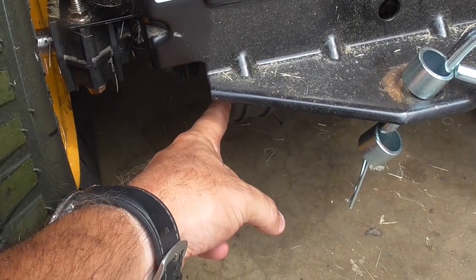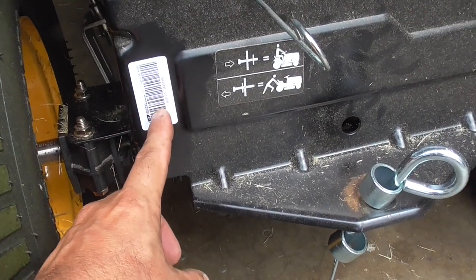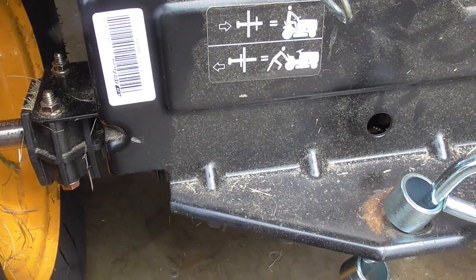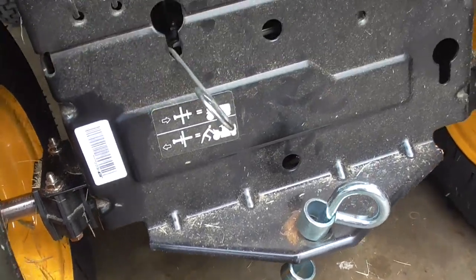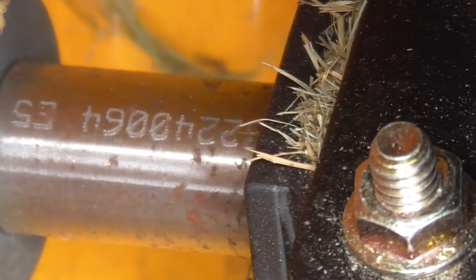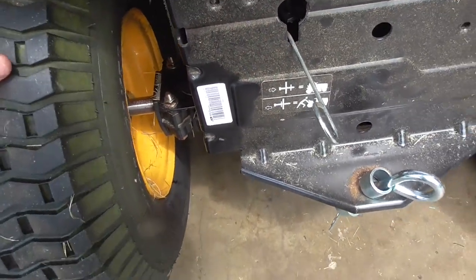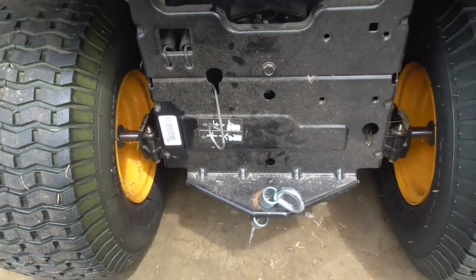On the bottom stuck down here was a tag, so you might be able to find a tag and then you have your serial number. You can look that up on General Transmission's website. If that tag is missing, they stamp it on the axle — if I look in here at the axle you can see the number stamped there. I believe it's on both sides of the axle, but it's at least on the left. You get that number, go to their website, and you can find the belt.